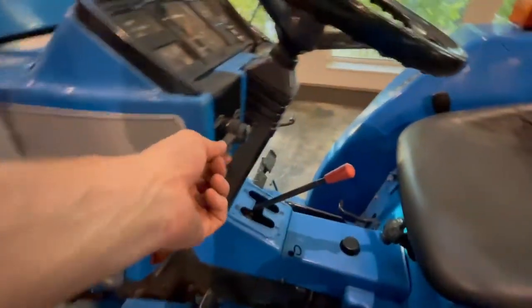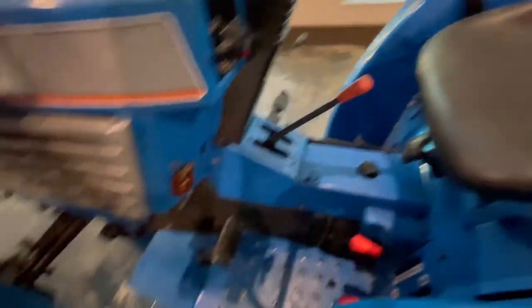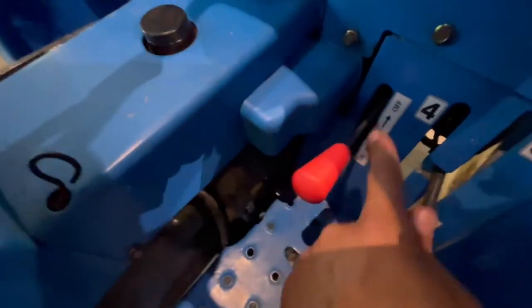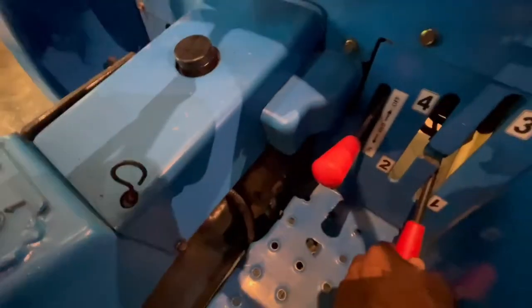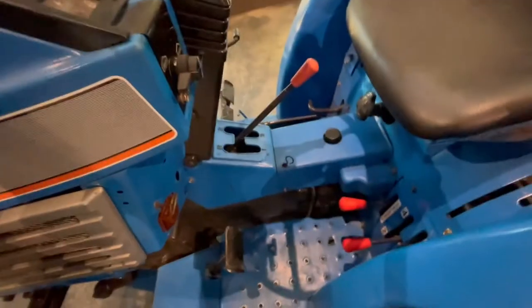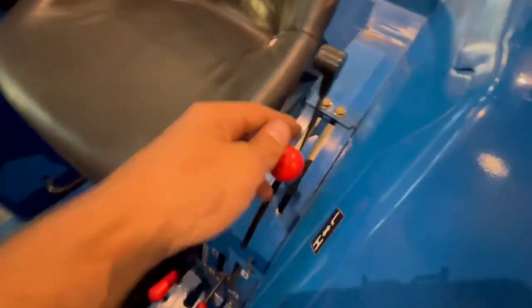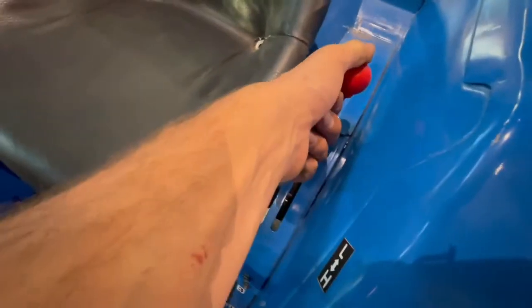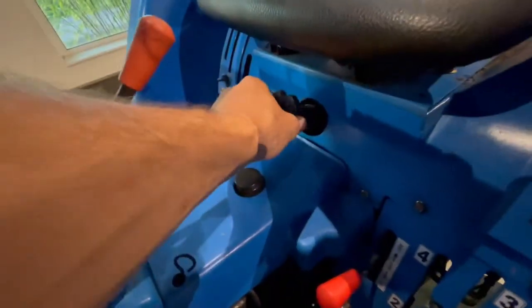On this side, these are the indicators and this is the light switch. And here you have the four-wheel drive — this one says four-wheel drive off/on. Normally it's in Japanese, so this time you can read it. The PTO has four gears, which is really good. Normally when I go mowing with a grass mower, I take it in second gear — it's like 540 RPM. It doesn't need much RPM and it's still very strong, so that's the best gear to use. This is also the low gear and the high gear, as you can see on the fender. This is the valve for the back lift — if you have a really heavy machine and want to lower it slowly, you can adjust this one so it won't go down too hard.